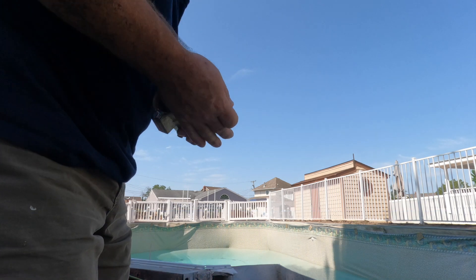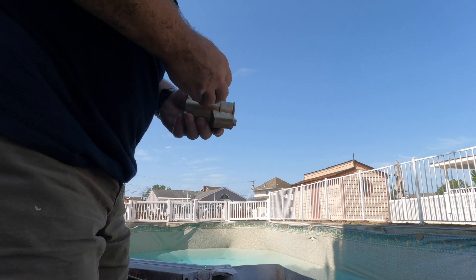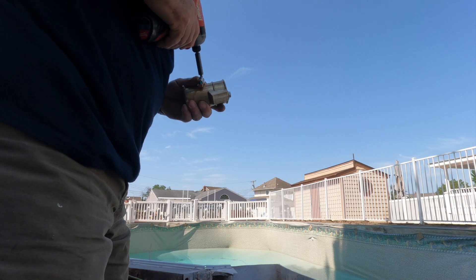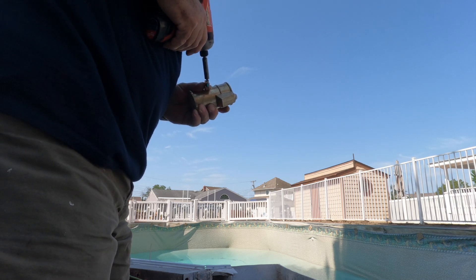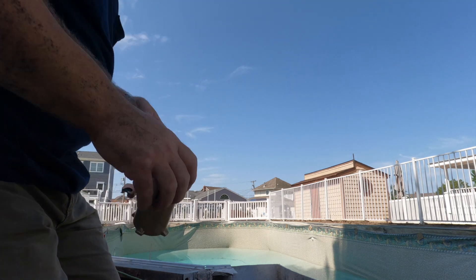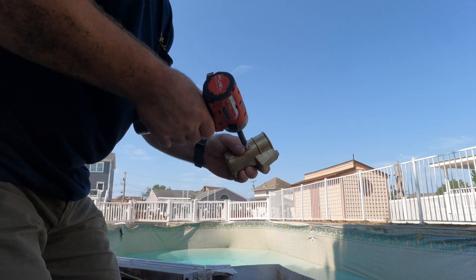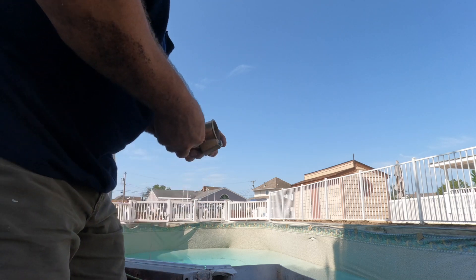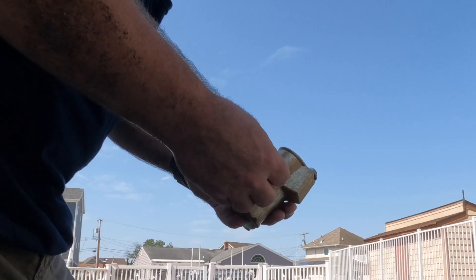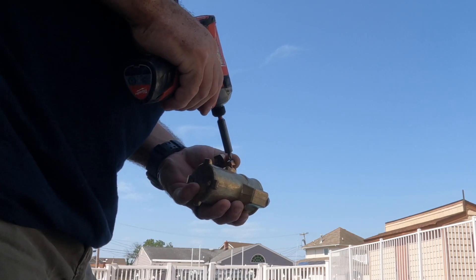The reason why we use stainless steel here is that stainless steel is going to resist rust and corrosion. That's why we use stainless steel hardware around the pool - anywhere around an ocean or close to the ocean. I keep an array of stainless steel hardware in my truck to do the job right the first time. These two things are the handrail holders. They come with a stainless steel screw, so we just attach a direct burial grounding lug directly to it with that screw, and that's how we electrically bond the handrails in the swimming pool.